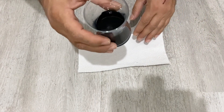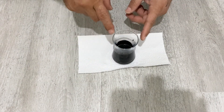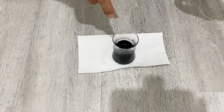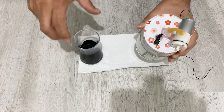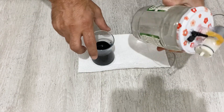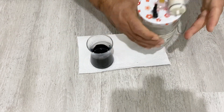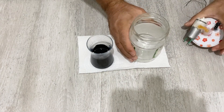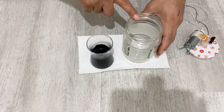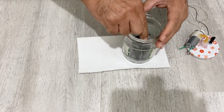After mixing for about half an hour I got this — a very nice conductive paint. You can directly use this conductive paint for your project, but for better results I'm going to put it in a vacuum chamber and degas it to remove the gas inside the paint. If you don't have a vacuum chamber you can use it directly. By the way, there's a link on my channel for making a homemade vacuum chamber.